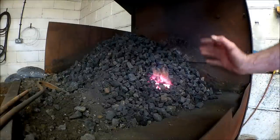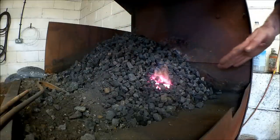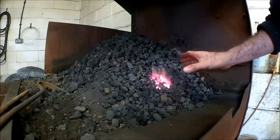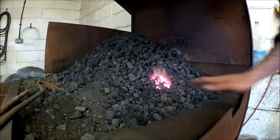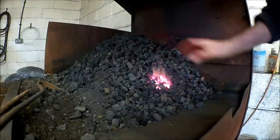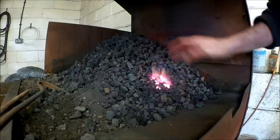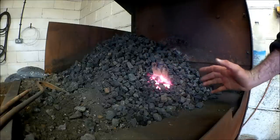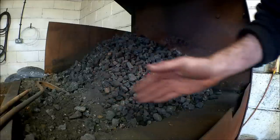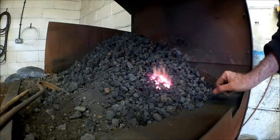So this is now the fire coming up to temperature. I've got a nice big mound. The way the structure of the fire slopes in, I've got a nice little window of fire for me to use. The fire isn't coming out the top — it's here in the side. I can change the dynamics of this — this is what it naturally wants to be — but I can change the dynamics if I'm doing something bigger or complicated shapes by moving and scraping some of the sand away and placing the steel in different positions.